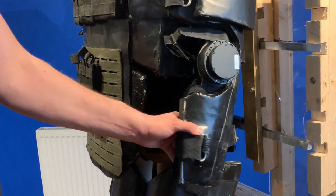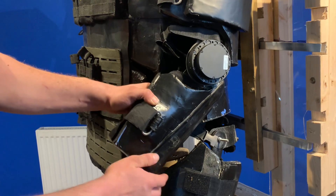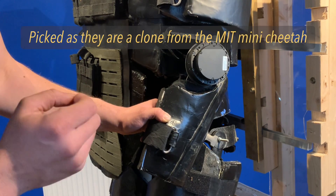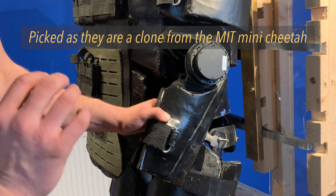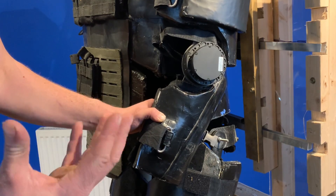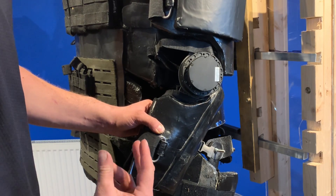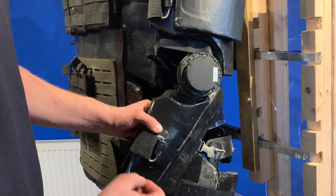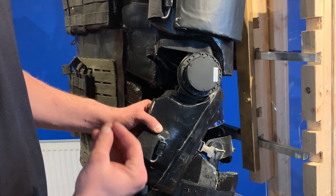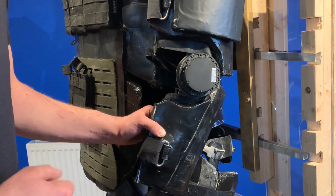Coming around to the other side, I've thrown on one of the actuators I've been trialing. I'm confident these are the type of actuators I'll use in the end, though I'm not sure about this specific brand — they're a Steadywing brand off AliExpress, so there's no technical backup at all, which isn't ideal. I do intend to look at better-branded manufacturers when I buy all of the actuators, which should be soon. They really are great actuators though — they have a built-in planetary gearbox around an inrunner motor, and a very clever board that lets you set torque, hold, bounce settings, speeds, and power levels, which allows you to sense movement in the motor without needing extra sensors.